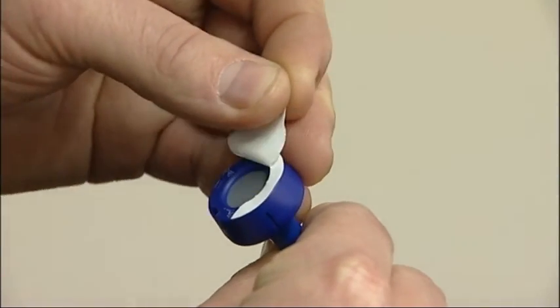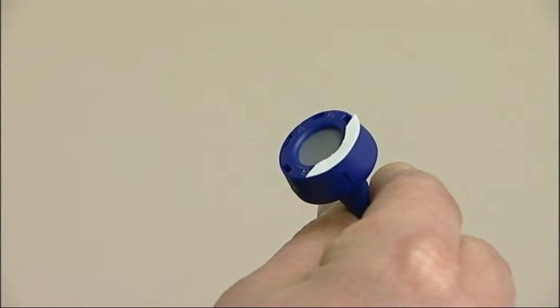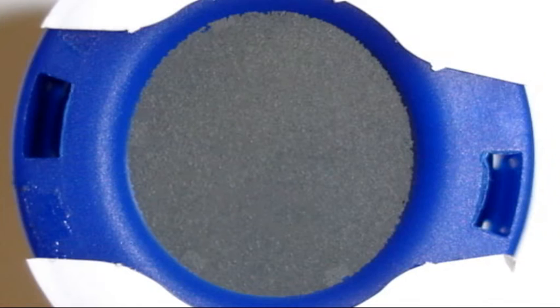Remove the impactor and peel off the protective seal. The impactor incorporates a series of three horizontal rows of nozzles. Any oil present in the sample in aerosol form at a concentration greater than 0.05 mg per cubic metre will be deposited on the display screen as a series of small dots. Each of the three rows has a different distance between nozzles, calibrated to 0.1, 0.5 and 1.0 mg per cubic metre. When the dots on each row form a continuous line, it identifies that the concentration level for that line has been exceeded. For this particular test, there are no dots present, so the oil concentration level is less than 0.05 mg per cubic metre — a pass against breathing air standard EN 12021, which allows a maximum of 0.5 mg per cubic metre.